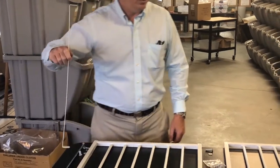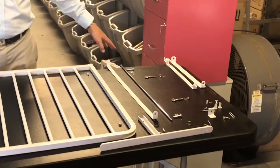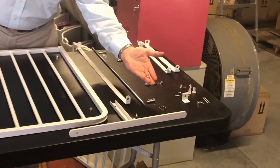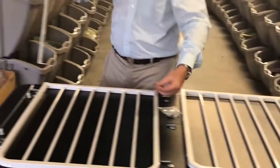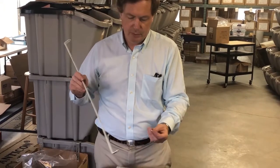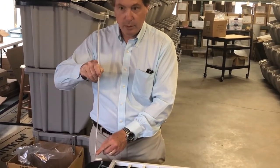And some of the screws that you'll use will come out of the hardware pack from the gate. And again, that'll be shown to you as well. So these are the 2 screws you'd use. Or if you're going into masonry or brick, you're going to want to drill a hole and use a masonry anchor because these just won't work. So once that's secured in your wall,